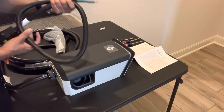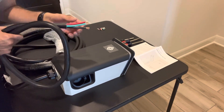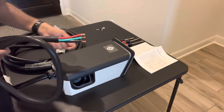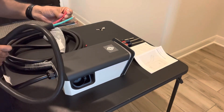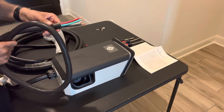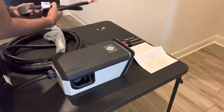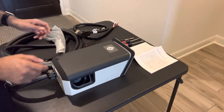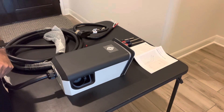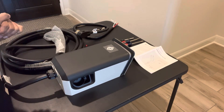One thing to note on the plug we bought: it did come with little connectors on the ends, so I just had to cut those off with wire cutters and strip the coverings to get some exposed wire. We're going to need the black, the red, and the green wires. The white wire we'll cap because it won't be used. I'm not an electrician, so if you're not comfortable with this, get an expert to help. But if you are comfortable, it's a relatively straightforward process — do all this at your own risk.